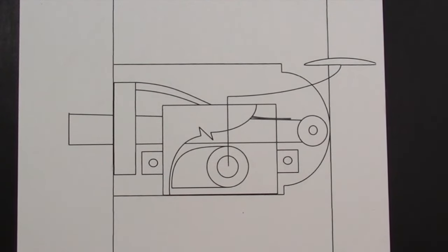So even though this drawing doesn't show all the final details of the finished latch, it is a scaled drawing and it does allow me to position all the major components that I want to use in that latch. Because if it fits in a scaled drawing, I can make it fit in real life. So now that I'm confident that all this is going to work, in the next video I'll start putting this thing together.